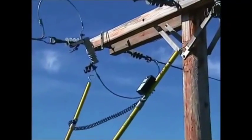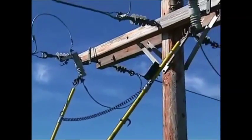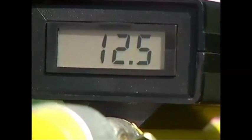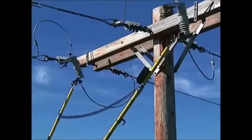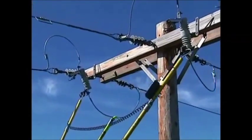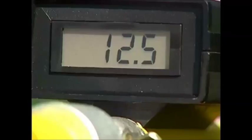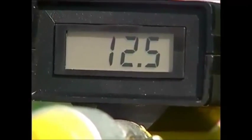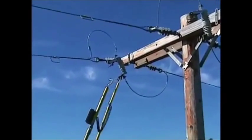You want to go to that field phase or road phase? I'm seeing 12.5 here, Kirk, so that's a phase-to-phase voltage. Let's check across field and road phase also. I'll pull that cord down a little bit. I'm seeing 12.5 here, so that's a phase-to-phase voltage. These circuits are hot on both sides of that switch.